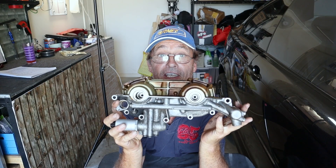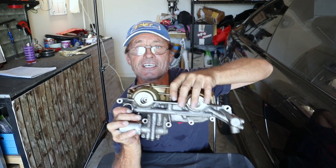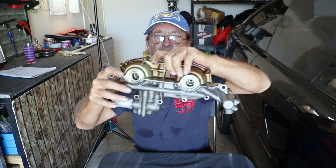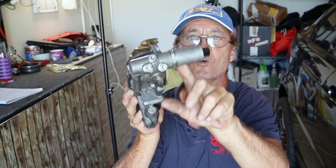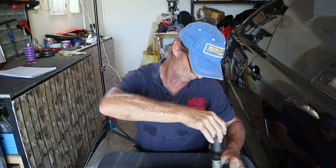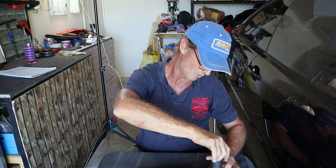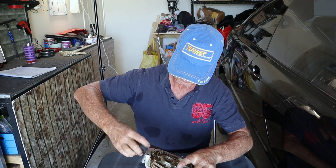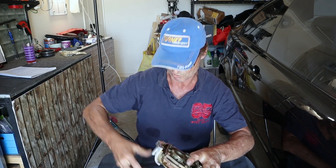This is the way it will sit on the front of your engine. This is your intake side and this is the exhaust side. You've got a solenoid on the exhaust side, and the solenoid on the inlet side sits pointing towards the back. I ordered a special socket from ECS Tuning — not sponsored — and the beauty of it is it'll fit over the solenoid housing without damaging the plastic connector on the top. I've already loosened these off a bit: that's the inlet side and this is the exhaust side.